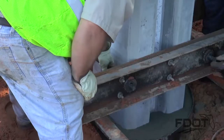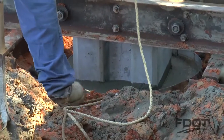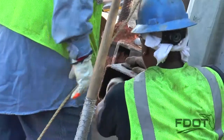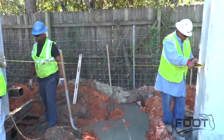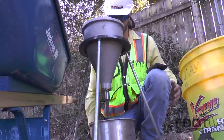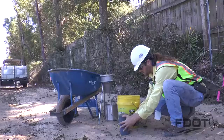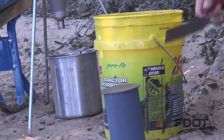The template is then manually tightened around the post and adjusted to ensure that it is held plumb and in proper alignment and elevation. The template position is held for a minimum of 12 hours, after which the template can be removed and reused. During the grouting, a separate inspector samples and tests the grout at prescribed frequencies. The temperature of the grout is measured along with the flow rate, and specimens are placed in canisters for later testing of compressive strength.